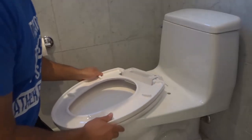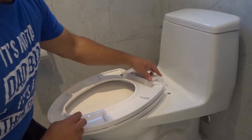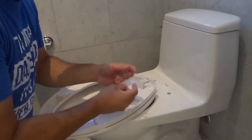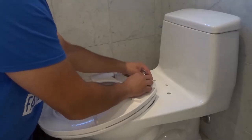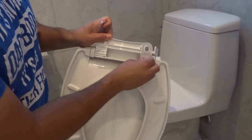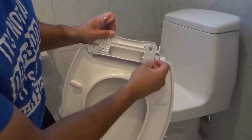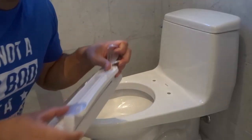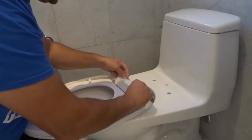What we're going to do is place the toilet seat right here and take our anti-slip pads and install them on the underside of the toilet seat — that's the side that's going to touch the toilet bowl. This makes sure that the seat doesn't slip back and forth and keeps those bolts secured nicely. They just go on in a very easy fashion; you can see they literally fit on — same shape, with a circular top and flat bottom. Make sure that the tabs over here are opened up, exposing the holes.